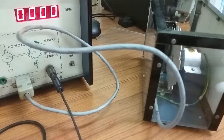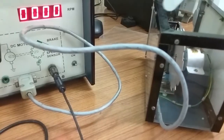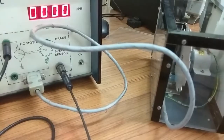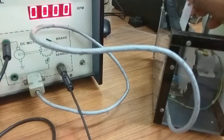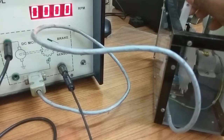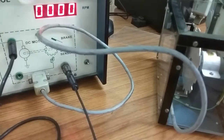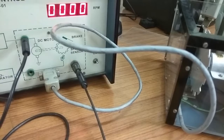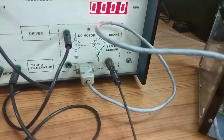This is the connection of the motor. There are five wires. The green and yellow wires are for the armature connection — armature voltage is applied from the controller to the motor by these wires. The other three wires — black, red, and blue — are for the speed feedback. This speed feedback signal is applied to the controller and converted into RPM.